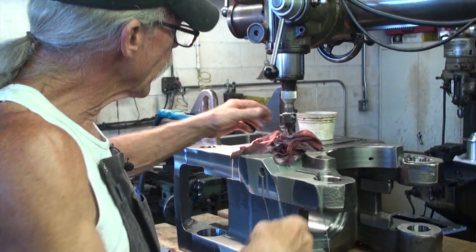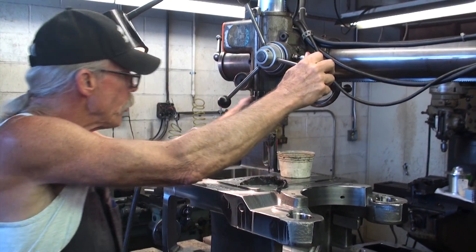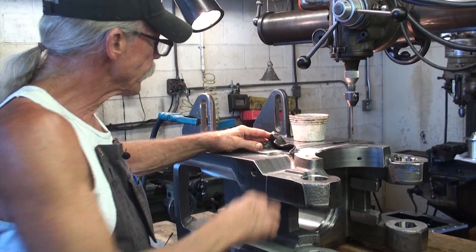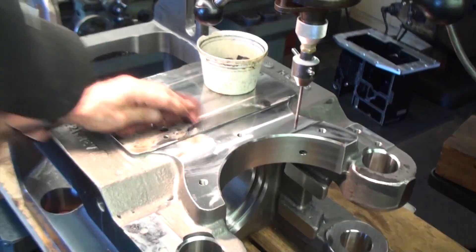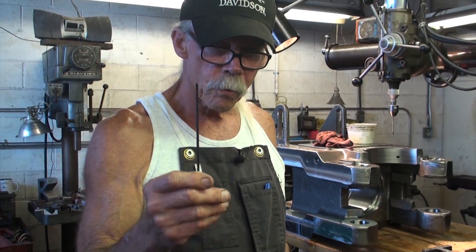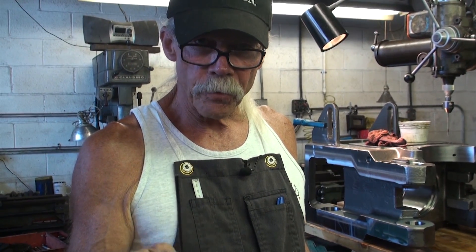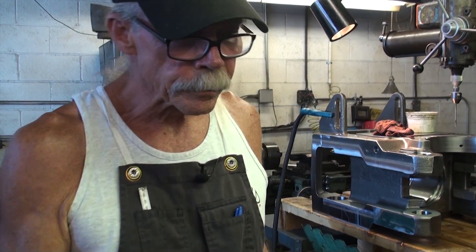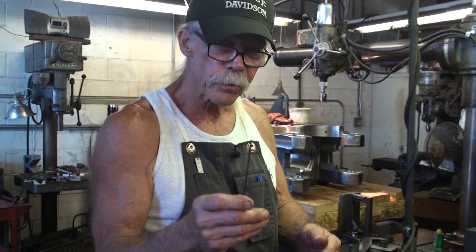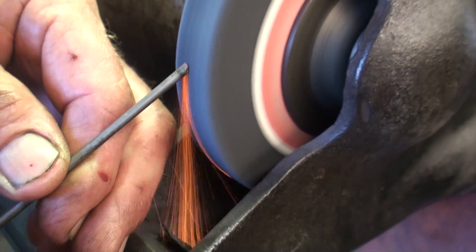I just fell through the tap, so that tells me that the tap is broken off shallow — not near the finished depth of 1 inch 100. Move the machine out of the way. Now we'll blow out the hole. Grab the hardened round chisels that are equal to the hardness of the tap. These are made out of a material called M2 and they're heat treated to about 62 Rockwell, so it doesn't just bust the end off. It keeps a fairly clean end and grabs the tap without doing too much damage to the rod. You have to grind this rod so it has a clean corner.